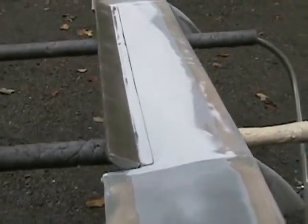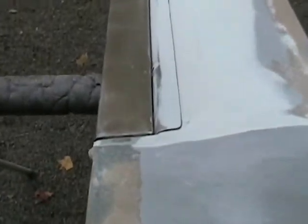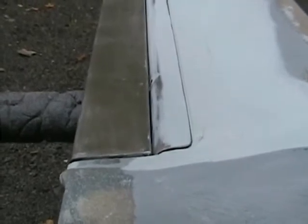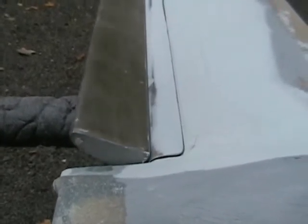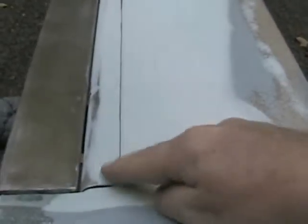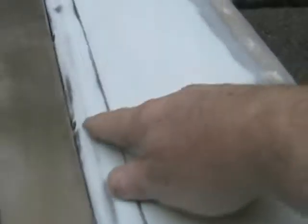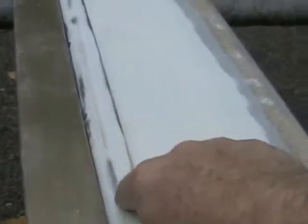The wing goes up and the flap goes down. You can see what I did here — there's a shaft rotating inside the wing that you don't see any linkage or anything on. What you see in front here is the cover. It goes down and you can see there are four small slots where pins go from the wing into the shaft that rotates inside.